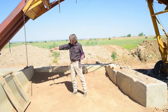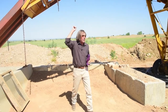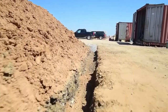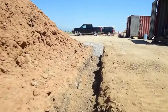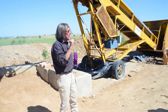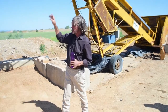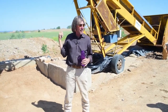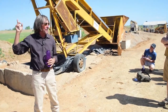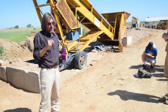Everything that's too big continues on down, and that's what's over here. Last year we had a quarter-inch screen on here. The soil is very finely screened and it works really great in the blocks, but with this soil it's pretty slow. We're not getting a tremendous percentage through the quarter-inch screen. My favorite dimension has always been three-eighths — that's what we used in Baja and in Texas.